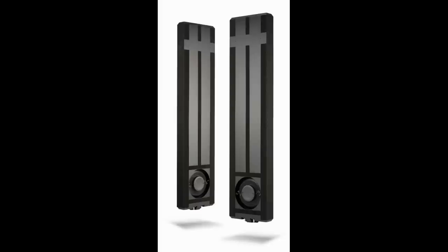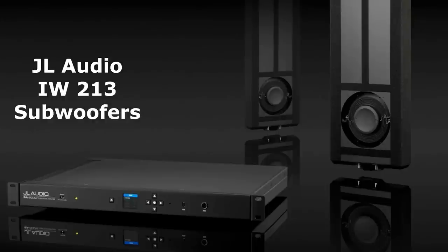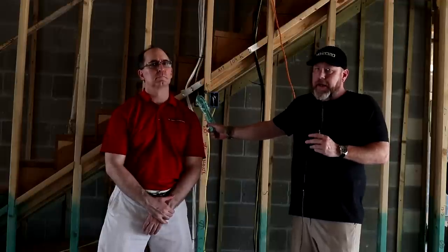This should give Gene everything he needs coming down from his rack. The subwoofers will be located in this wall, and we've got speaker wires coming down through here. Distributed video runs — if you're building a new home, thinking about building, or remodeling — it's a good idea to run a bundle of cables to the video device and run back to a central location.